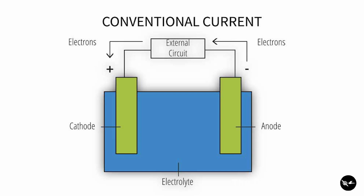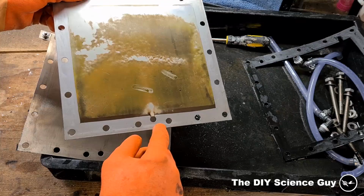This galvanic corrosion probably happened because when I turned off the power supply, I left the generator connected to it, and because the power supply apparently has a 100 ohm resistance between the positive and the negative output terminal, some current could run through it, and therefore the circuit was completed, and the generator became sort of a battery. I disposed of the oxides by wiping it off and putting it away as chemical waste.